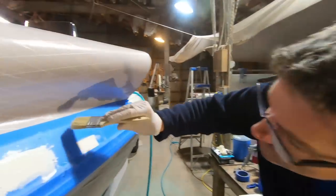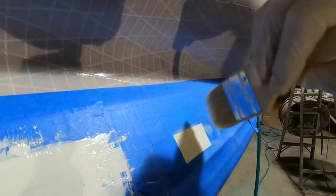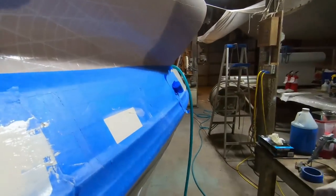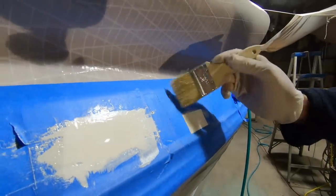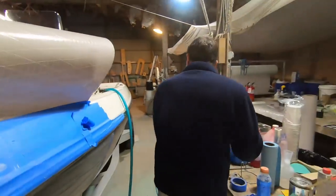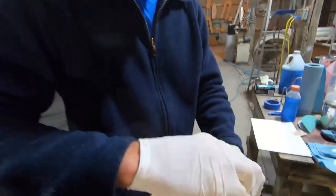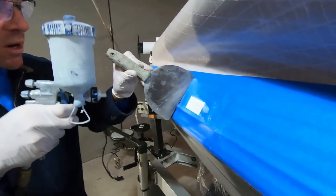Sometimes you can even use a brush and brush from the outside down, kind of softening that edge just a little bit. Now I'm going to show you guys as many different possibilities when it comes to repair as possible. I've got this little gravity feed cup gun I got at Lowe's — not terribly expensive — and I've got some PVA with the polyvinyl alcohol already loaded up in there. I'm going to use this putty blade as a shield and spray a very light coat.